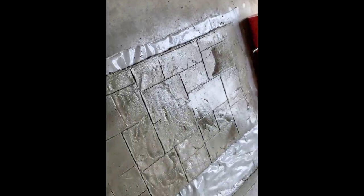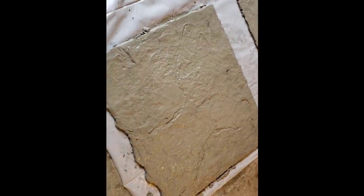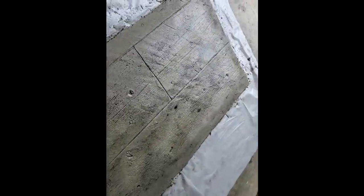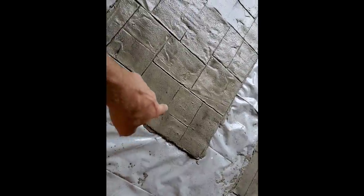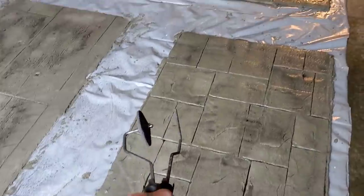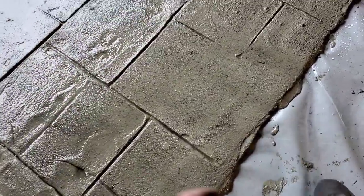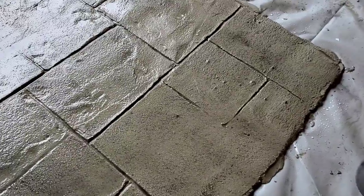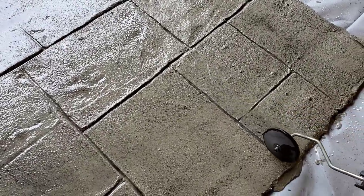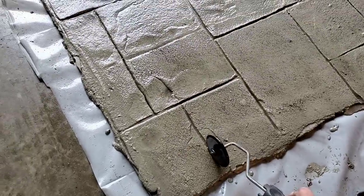That's the Ashler Slate Roller — that looks pretty good, gives it pretty good texture. There's the rock texture, there's the wood plank barn board. So there's a few little lines there that didn't show up. You can just touch them up by hand with the hand joint tool. We got a couple tools we use for touching up these joints, because that always happens with Ashler Slate. So you've got to have a touch-up — I'll try the roller on this one here just to fix those. All we do is just put it in there and roll that joint in just like that — it's perfect. Finish that joint off and then touch up anything we need to touch up.